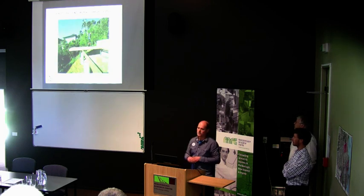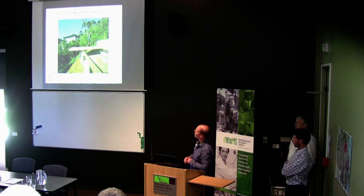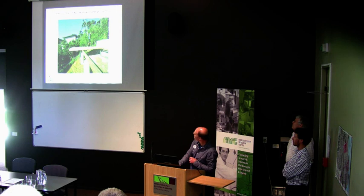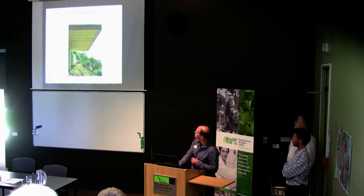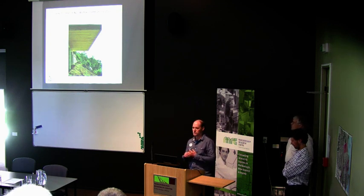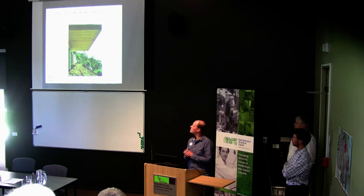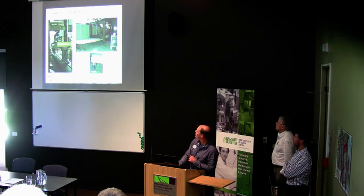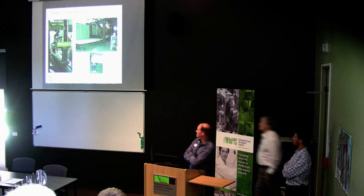There's one of the five-layer panels — as you can see, we've got quite a good cantilever going. With the five-layer panel we can also span both directions, so we could put it just on some posts. In the factory, we're dimensioning these on the CNC bridge that we'll be getting soon, so they'll be dimensioned to millimetre accuracy, making assembly very easy and quick. I'll pass back to Robin now and he'll explain some of the technical details and the testing we've done.